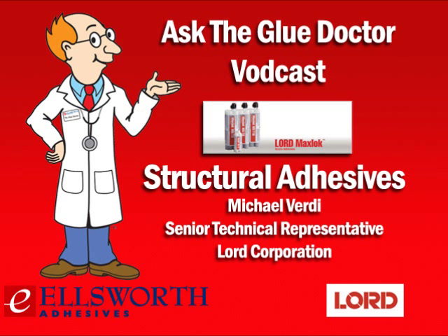Lord MaxLock Adhesives are used for building sidewalls and floors for medium and large types of over-the-road trailers, like a UPS-type truck. They work very well in creating a uniform, structurally sound body that has the added effect of an outside aesthetically pleasing, smooth appearance, unlike the weld scars or bumps associated with using rivets or screws for similar assemblies. The Lord MaxLock Adhesives are also available in gray color, which allows them to blend in well with aluminum or galvanized substrates, especially for the interior portion of an assembly, making it less noticeable compared to other means of assembly.